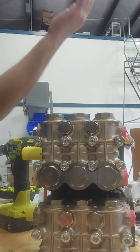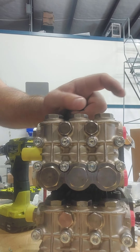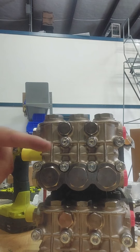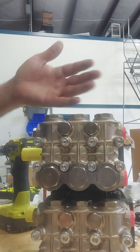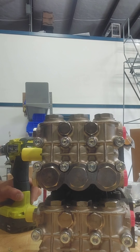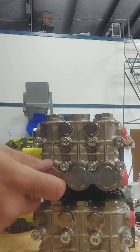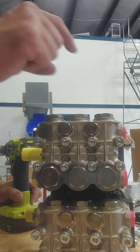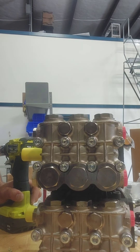This is the AR pump that runs 3,000 PSI at 5.5 GPM. I'm not going to talk about the pump itself, but something you can do to troubleshoot these and every other pump. What we have found is pump manufacturers are having issues with putting too much Loctite in Italy on the threading, and the check valves from the manufacturer are locked in place and require us to break the tension, or else you're going to have issues with them.